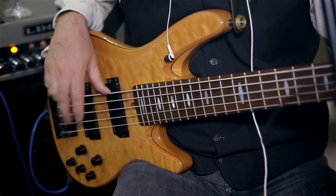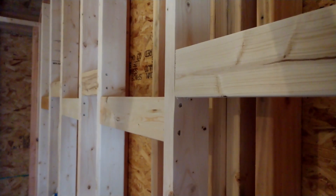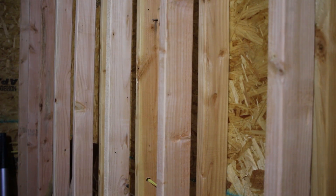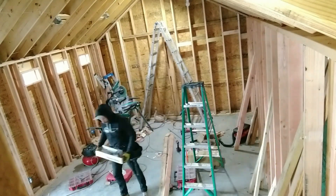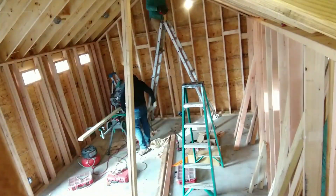Now let's talk about your walls. With a practice room, you're going to probably have drums and bass and be really loud. I highly recommend doing the highest level of soundproofing, which I call double walls. You're going to have your outside wall structure — whether that's in your basement or garage — and then build a second set of walls framing one inch from the outside of that wall, creating an air gap. You frame your walls just like you would build any house, just normal framing, building it with a one-inch perimeter around the inside of your room so those walls are not touching.